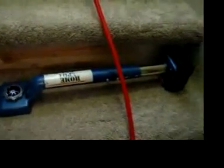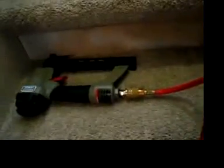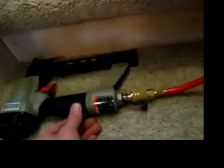Now with that done, I've pre-measured my pieces of carpet, and I hook it on the underside of the bullnose first, and I wrap it around, and then I use a knee kicker tool that I rented at my local hardware store. And since I'm going to be using trim to cover up the backs of the stair and the underside of the bullnose, I just use this nail gun with staple brads to fasten it.